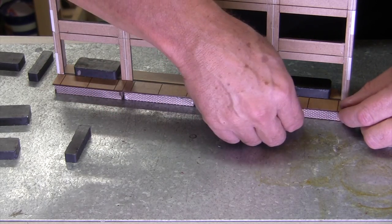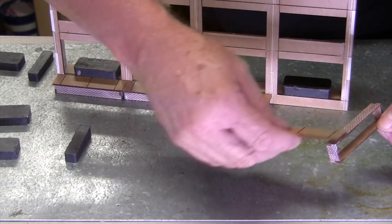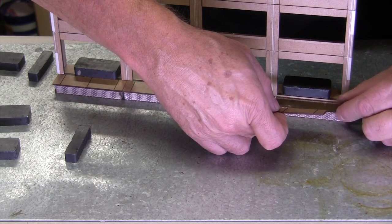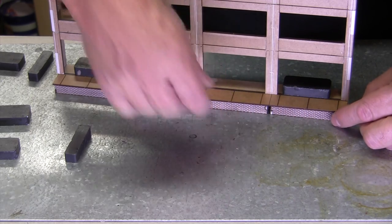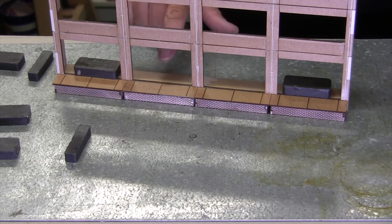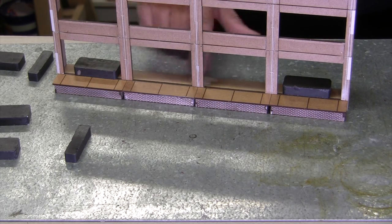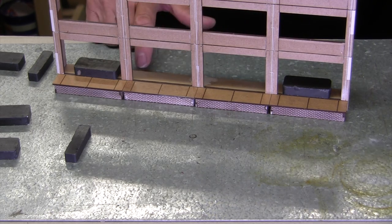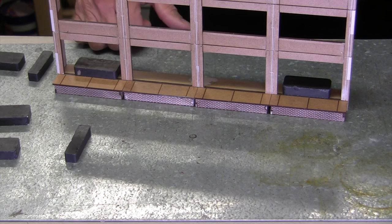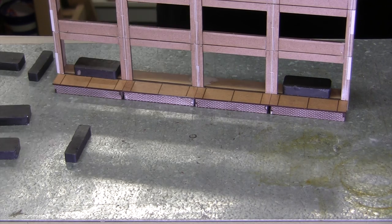And so you glue the back surface to the panel and the deck on top. And then when you've done that, use a little bit of filler just to bridge any gap that's here. Leave it overnight, give it a light sand, a little bit of sander sealer on it afterwards, and it's ready for painting.